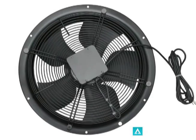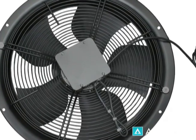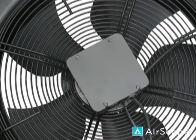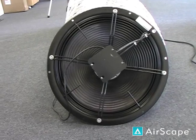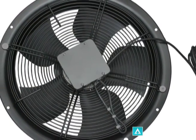At the heart of the 3.0 lies the remote mounted 18 inch industrial grade EBM fan motor. This maintenance free fan is extremely robust with an industrial build quality that offers long life cycles and is capable of handling high static pressure loads. At 360 watts, the fan yields an impressive efficiency of 8.5 CFM per watt.